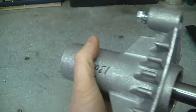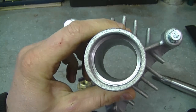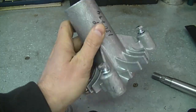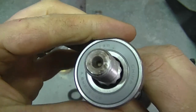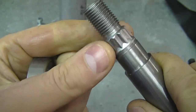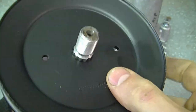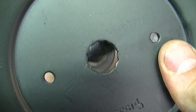Here's the inside of the spindle — it's just hollow. You can pop the other bearing off, and once the bearings are out it's just hollow like this. It's basically just a shell that the shaft and the bearings go inside of. You're going to have a larger bearing at the bottom and a smaller bearing for the top. You can see here that the shaft is splined — this is for the belt pulley to go on. I've got a pulley here just to show you how it goes on the shaft, just like this.